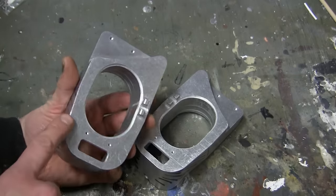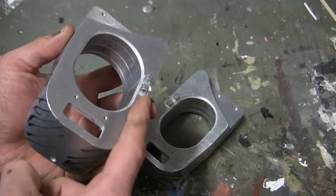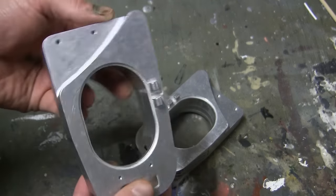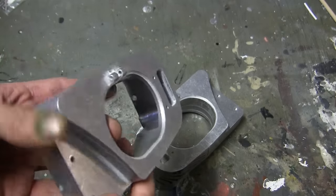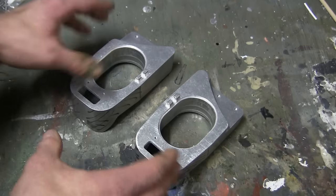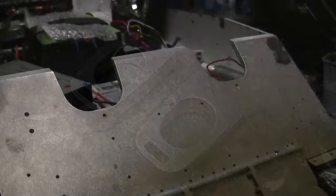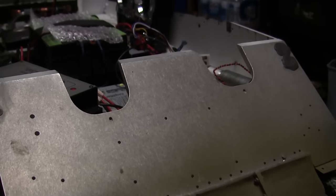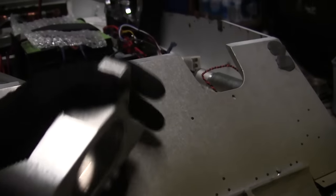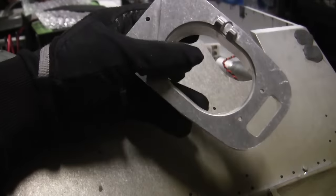Now, in addition to removing the material in the front, the entire component will also be rounded. The squared off nature of the part here is a little too squared off for representing a Sherman of this pattern. As on the real Sherman tank, the entire front hatchwell area was a piece of cast steel. While performing the hand fitting to the bow hatchwells, it is a good idea to periodically stop and test if the pieces are fitting properly. It gives you a gauge on exactly how much material, if any, still needs to be removed.